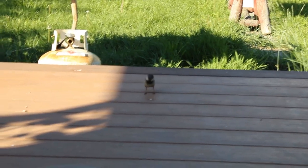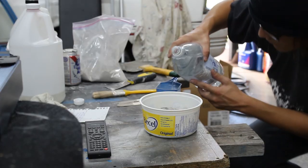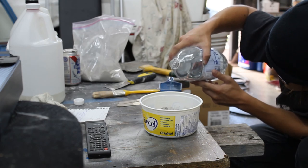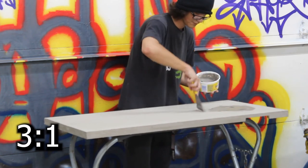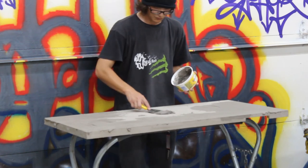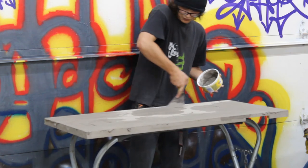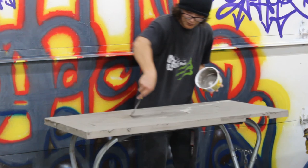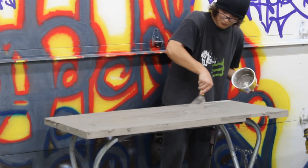With the concrete there's a lot of waiting for it to dry, but once it's all dry or relatively hard, the next coat will be your trowel coat — your top coat — at a mixture of three-to-one. It's called the trowel coat because you'll want a decent-sized trowel. Mix it up, slap it on, and level the surface to match your edges. If you have a little high edge, fill that in. You could also repeat the trowel coat to do two trowel coats if you want it perfectly smooth.